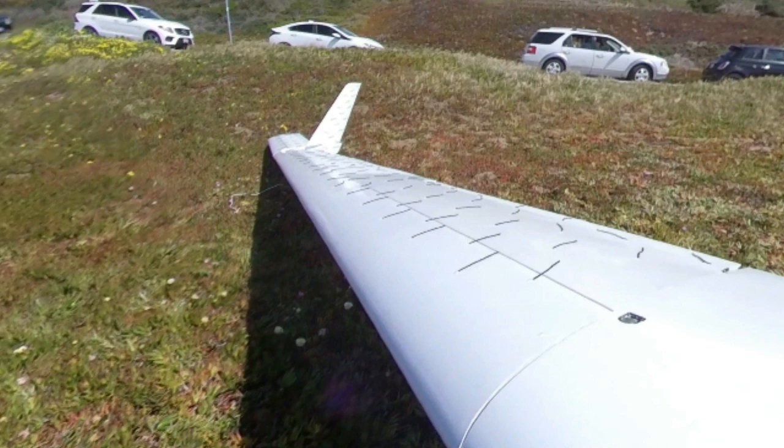It's good for spotting things like stall, or for flying wings we're often interested in spanwise flow — it's very good for that also — or separated flow. We were out recently doing ground testing on the wing. I'm strapped into the cockpit, using the normal flight controls to fly the wing in place on the ground.